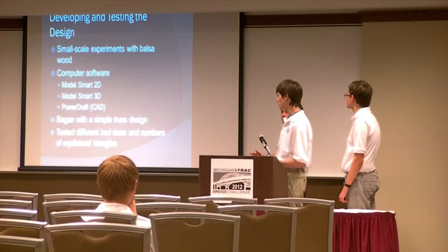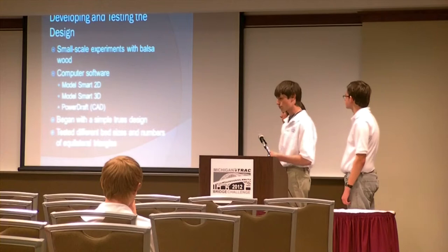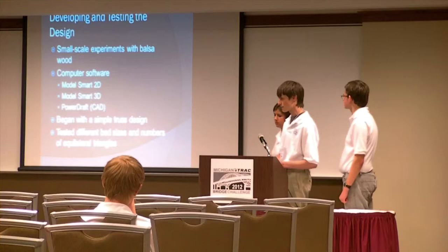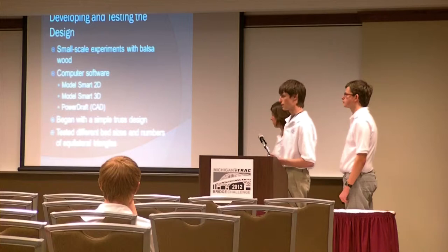We put it together to see how it would fit and how the ratio would hold as each piece was actually assembled. After that, we designed everything and put it into the CAD software, which was really essential to helping us build the actual bridge and getting exact measurements and angles. We started with a simple truss design — basically just a rectangular prism — and then used the program to save time and resources, stepping up from our first design to find better ratios, test different arch shapes, and even adding in a trapezoid into the arch of the deck.